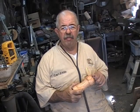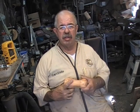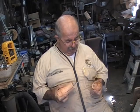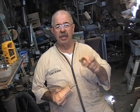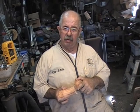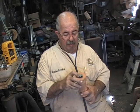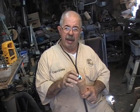After you've done all the finishing, and it really is easier if you do as much as you can while it's spinning on the lathe, then you have to put it together. There's a keeper that screws to the bottom of the lid that grabs the square bar. There's also a keeper that goes across the bottom down here to keep the mechanism from coming out.